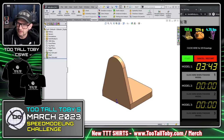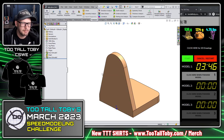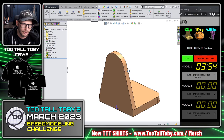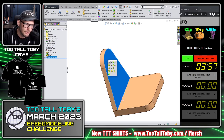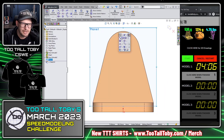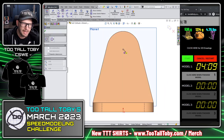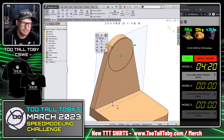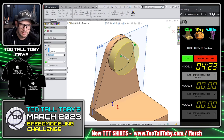For the ring on top — it starts two millimeters off this face. I could offset during the extrusion or sketch on a plane two millimeters off. I'll use S key > Reference Geometry > Plane to make a new plane offset two millimeters, select that plane, begin a sketch, orient the view, and wake up the center point. Remember: dropping onto the arc doesn't create a relationship, but dropping at the point does — saving an extra co-radial step. That extrudes out to a depth of 14 with reverse direction.